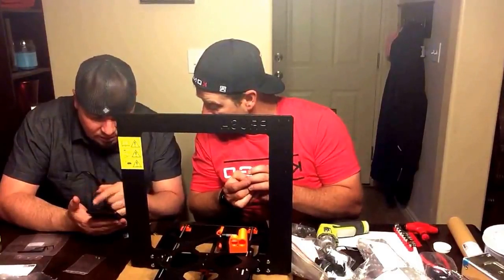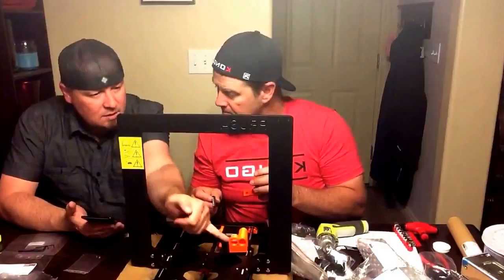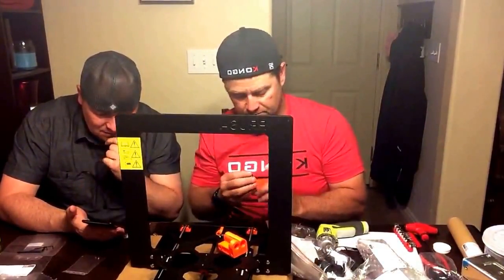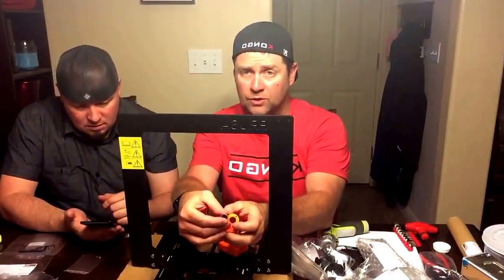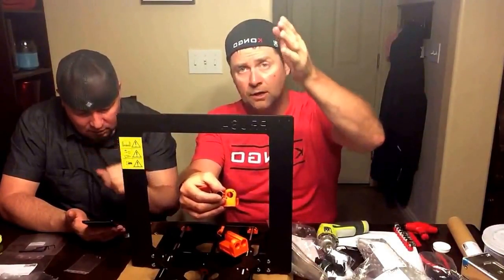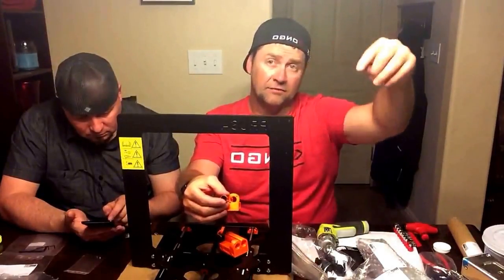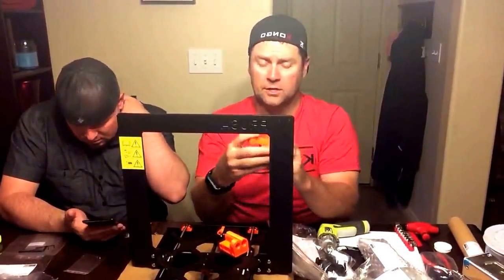Oh, they want the bearings. I wonder if we did that wrong on the other ones. I didn't see that stuff on these ones. But see the tracks of bearings between the two. I see what they're doing. They want you to offset the bearings. So when the one pushes through, they want you to turn the other one 45 degrees so that you have more coverage for the linear rail. So when you divide the linear rail, you're getting 6 paths of coverage through the bearing, or 8. It's just for stabilization.